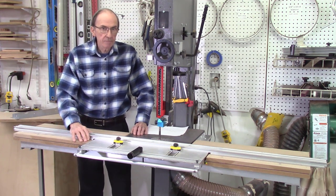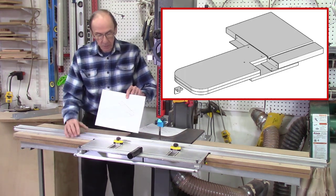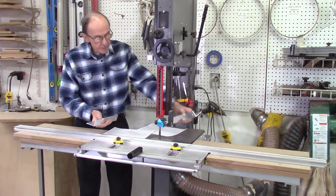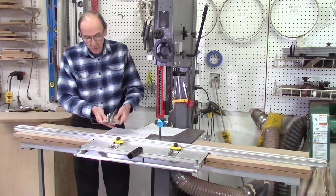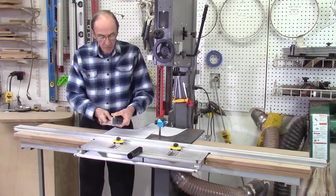So I took my initial design into SketchUp software and started redesigning it. I came up with a new design — much simpler. It basically uses two angle irons. These angle irons have a series of holes to enable them to be mounted on the sides of your bandsaw, additional holes to mount some MDF boards, and a slot for the miter bar on your bandsaw.